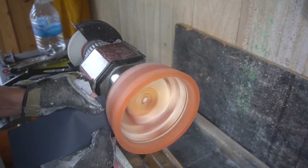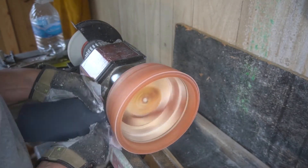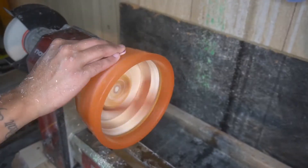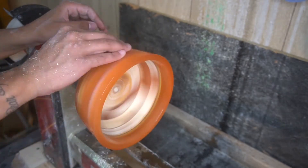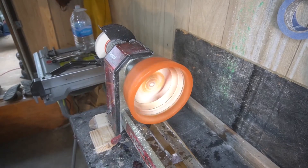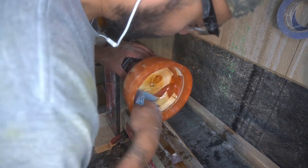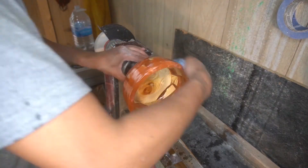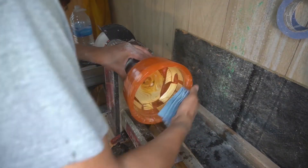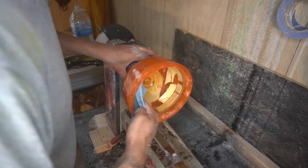Got the workbench cleaned up, starting at 380 with some dry sanding, going to work all the way up to 1500. Then we're going to come back and hit it with a micro mesh — this is where we do our wet sanding, just on the epoxy portions, not so much where the wood is. This is where you really get your polish and it really looks like a creamsicle, like real ice cream. I love how this bowl turned out, the marbling on it. Once you hit it with that beautiful wood wax it just pops. I absolutely love doing these swirl bowls.